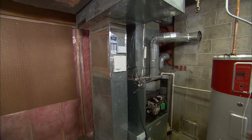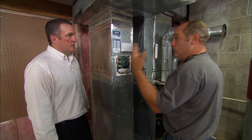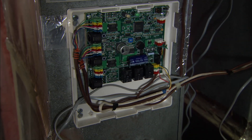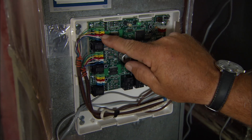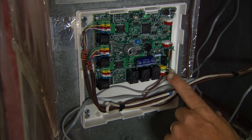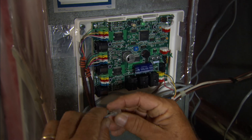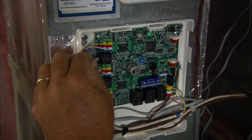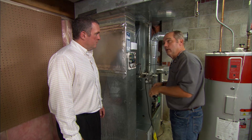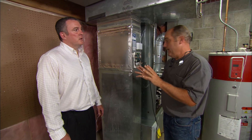All of our new wiring comes back to this control panel — we need a way to communicate between the thermostats, the new zone dampers, and the furnace itself. Everything's color-coded here. Here's the first-floor thermostat wired into this strip, here's the second-floor thermostat right here, and the same connections going over to the furnace itself. The connections to the first-floor zone dampers use the phone jack connection, and here's the second-floor connection right there.